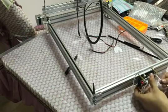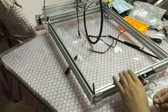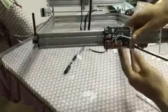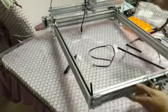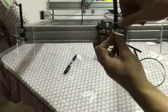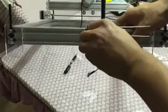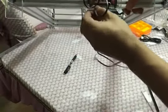I remember you must fasten the control card on the back of the X axis step motor, not the other side. You find the two small bolts. And then fasten the black tube. Yeah, like the video shown, fasten the black tube with the small white belt. You see the 2P line? Insert the 2P line on the right of the red button. This is inserted on the X position.